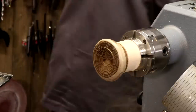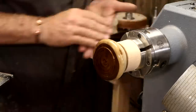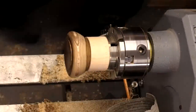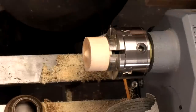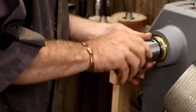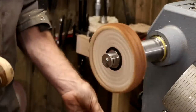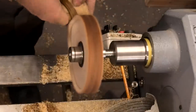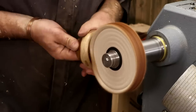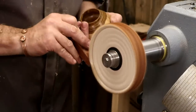Point the skew. Back to the sealer — wipe the brush off quite heavily, don't want loads on here. It's a big brush though. Feeling with fingertips how the shape flows — that's good. Take that out — we need to take the chuck off now. Let's do that polish. Most of you will have seen this — I'm going to go with the Twist and Fix setup, just really was here and ready to go. I want a brown compound on a stitch mop. Brown compound will cut back the raised grain of the sealer. I can work in any direction. Look across it — this is mildly abrasive. Brown compound is a polishing compound, first stage for steel and brass — it'll do with those. A little bit, you don't need loads.